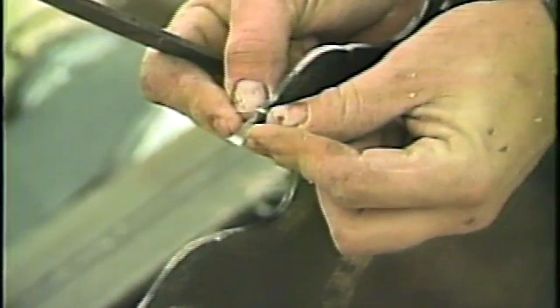The most critical part of the whole saw are the points of the teeth. Somewhere between 50 and 80 years old. And the gullets are another piece. And then the tooth. When the tooth gets filed back too short, you just roll the gullets out, set another tooth in, and twist it back in with a special wrench.